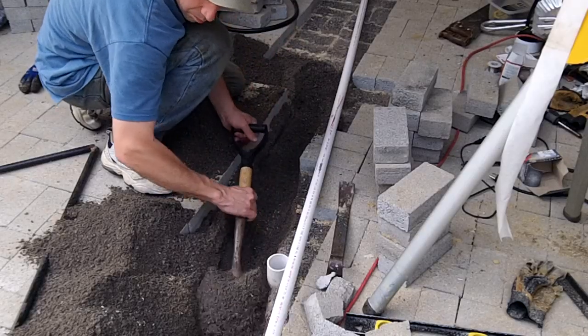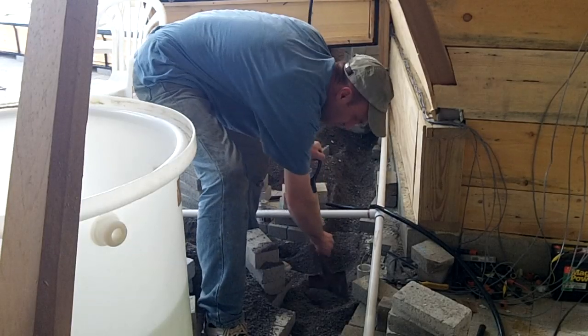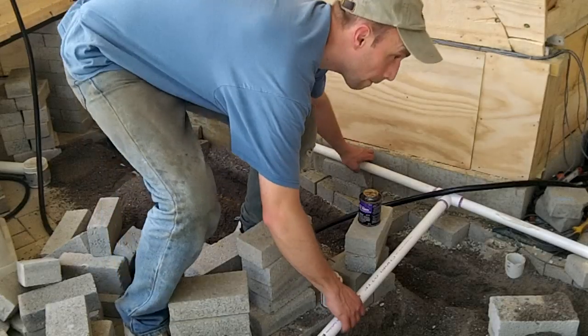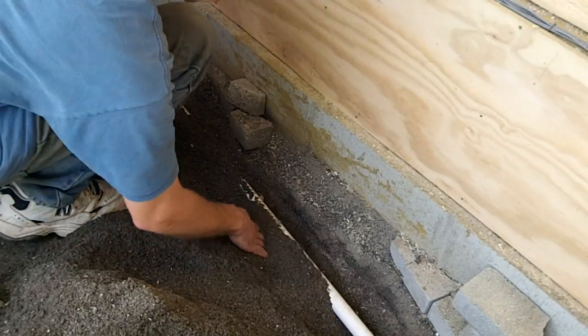To keep them out of the way most of them are buried under the floor. Originally I wasn't exactly sure where all the beds were going to be placed and didn't want to bury these lines while building the dome. Instead there's a layer of sand under the brick. The bricks and sand are easily removed and the supply line drops right into place. Once all the plumbing is laid down the sand is replaced and compacted and the brick flooring is reset.